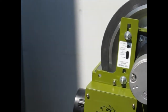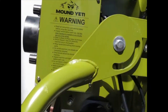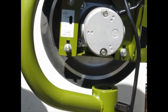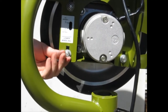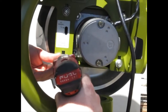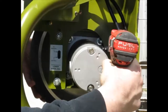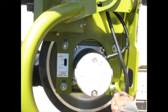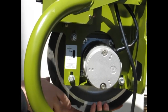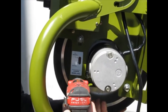Next, we're going to bring this bottom wheel assembly up to the top of these slots here. As you can see in the diagram, the bottom of the slot is set for softball, and bringing the motor to the top of the slot will set it to baseball. Go ahead and loosen all four of these nuts here on this bottom motor mount. Bring the motor mount all the way to the top of these four slots so that it can't go any further up. Hold it in place and tighten all four nuts.